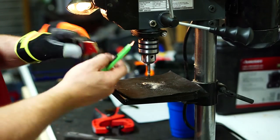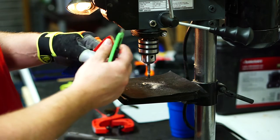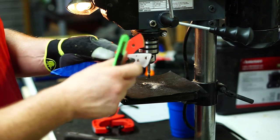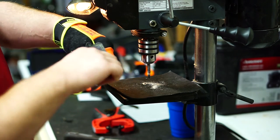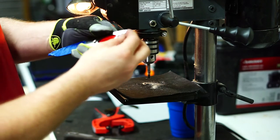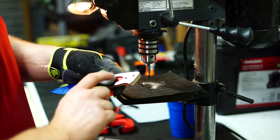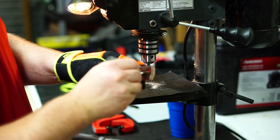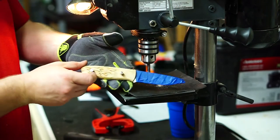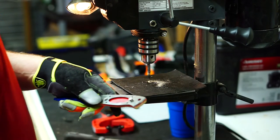When drilling the quarter-inch holes all the way through, going through the top or bottom has a tendency to push in the plastic on the scales rather than cut it cleanly — it heats it up and bows it into a funnel shape. So I'm using a razor blade to clean that edge up so the pin does not grab onto the plastic on the way through, allowing it to go through without causing separation.